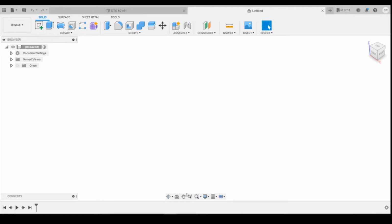A couple of people have asked me about how you can find out what your printer can achieve and the level of detail that is visible or isn't visible. Probably the easiest way to do this is to produce a test square, and then you can add some details to that which show you what your printer can or can't do, and then you can define your CAD work to show how to go around that.